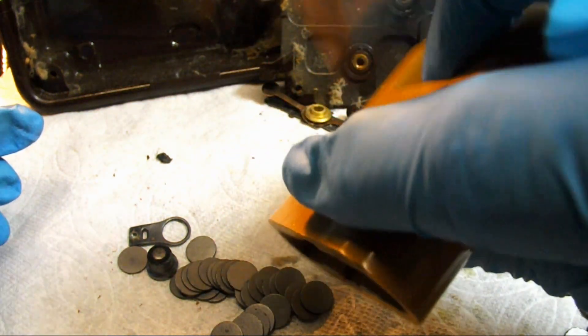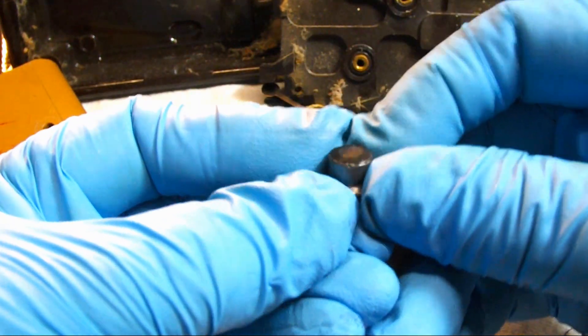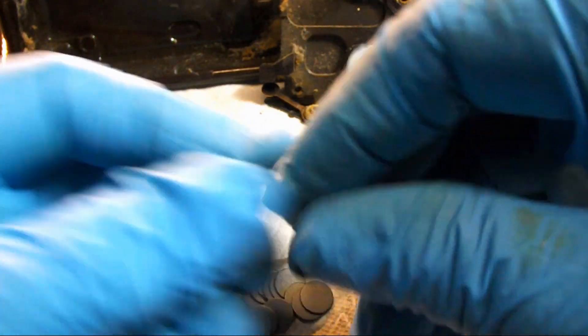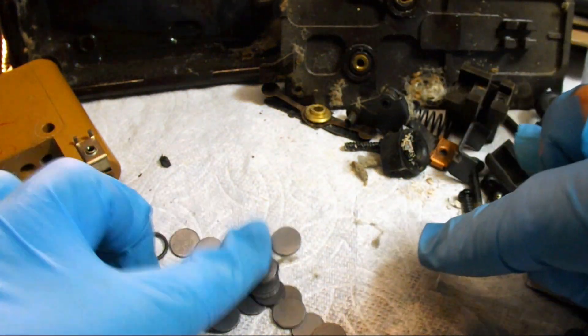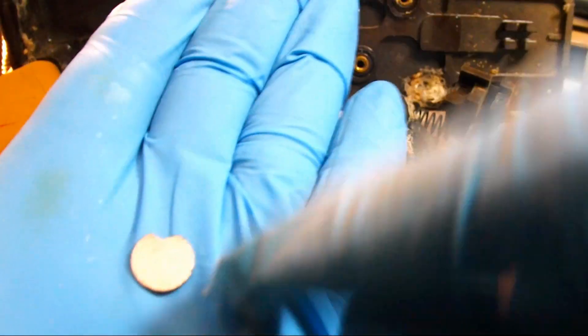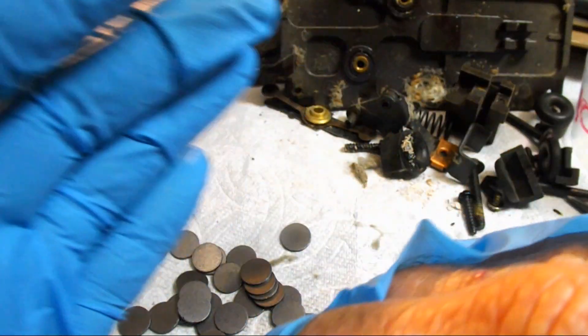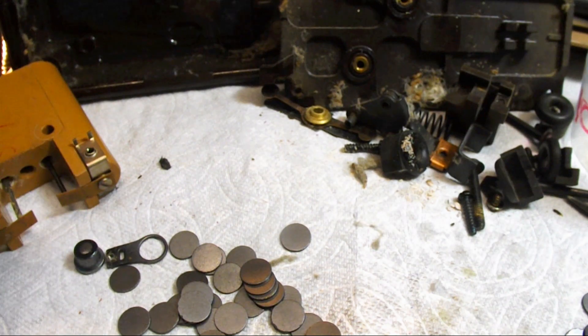There's over 50 on each side here. We do that because we want to clean the housing, and sometimes there's burnt carbon. I don't know if you can see the black rim there — we need to polish that off. We need to check all the carbons to see if any of them are burned or damaged. Like in the other stack there, you can see there's a little chunk out of one — looks like somebody took a bite out of the cheese. That can make an uneven electric flow.